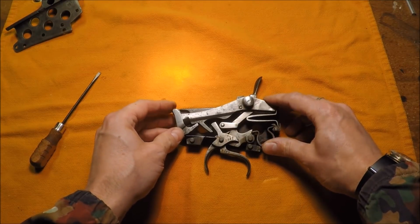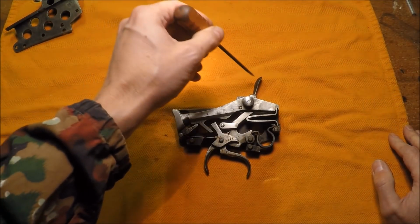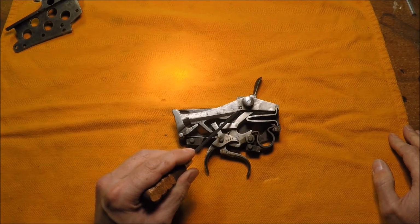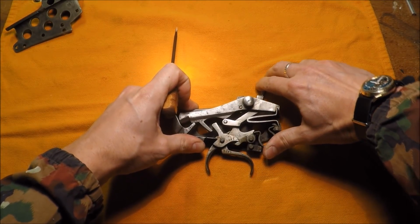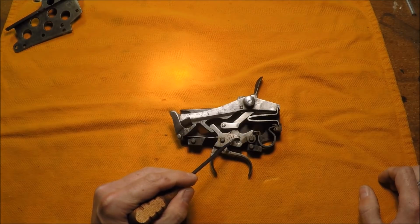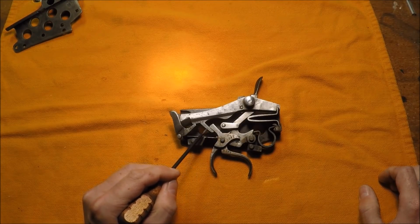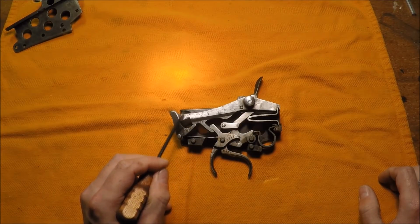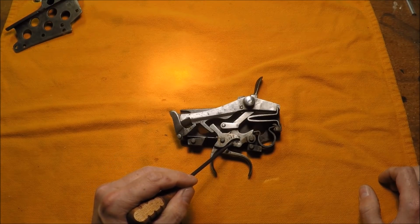So there we are, everything's in place. So I'll just go over it one more time. Thumb the striker back, roller contacts the camming surface, pushes the block up. I can show you a little bit how that works. There we go, see? Like that. As we do that, the stud here pushes up against the back of this hook surface, makes the locking arm pivot down, and underneath the strut of the breech block, and locks the block up in a raised position. The sear will engage in the notch here and lock the system out.